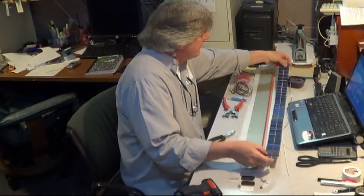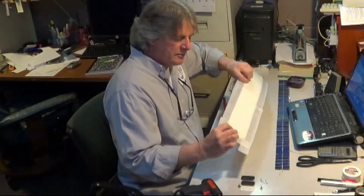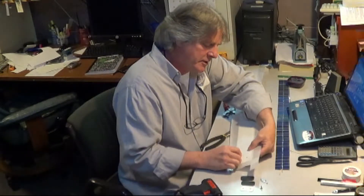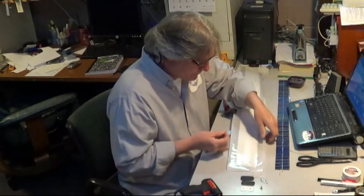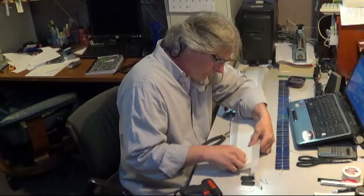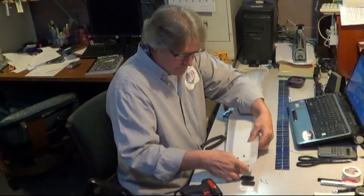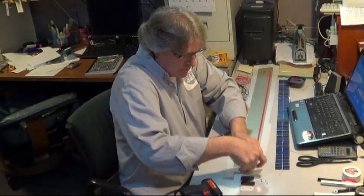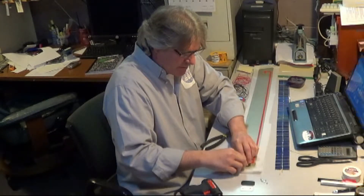So take your solar cells off of your panel, just flip it over. These are number six machine screws, one half inch long. Just set them through the holes that we made in the earlier steps for the squeeze connector. Flip it back over, just kind of hold those in place while you're flipping it over. Those two machine screws — that's your first layer of insulation.